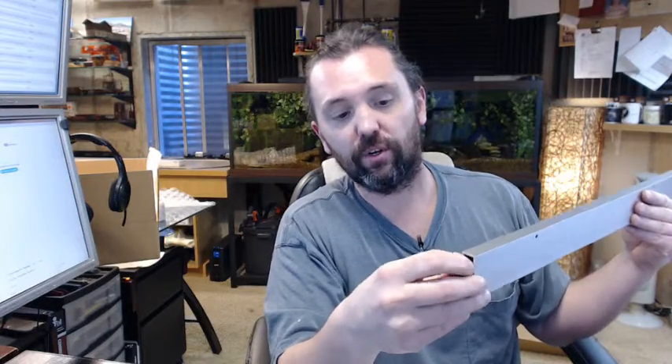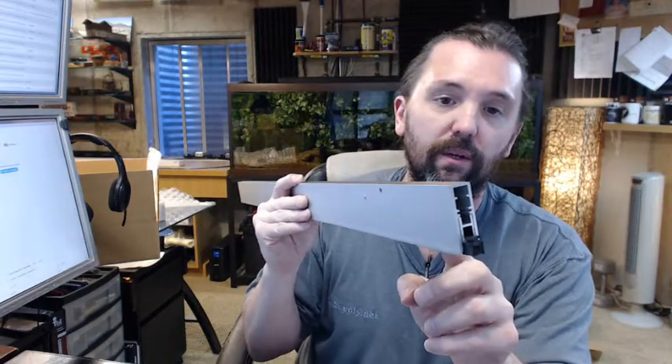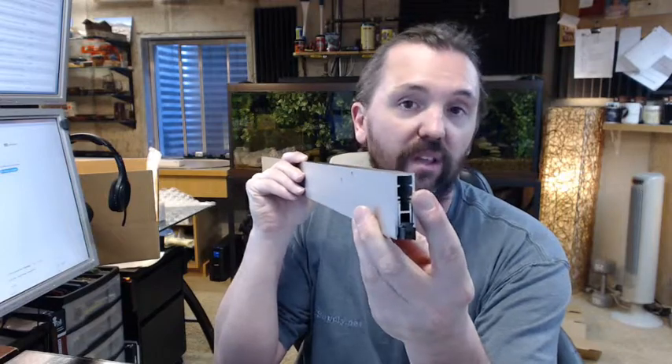When you are going about your installation, you are going to want to stand on the push side of the door with your tape measure. If you are installing it in a surface mount fashion, measure the distance between the stops and deduct about an eighth of an inch — that is the dimension you want to cut this to. Only allow yourself about two inches of trim, or better yet, indicate in the comment field the net length you want us to supply it to. The factory is already cutting all the components to length, so you might as well cut it to the exact length you need. If you are going to semi-mortise it, you need to go the width of the door — keep in mind your door might be beveled or square edge, so you may want to compensate for that a little bit.